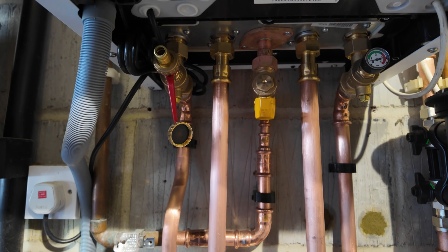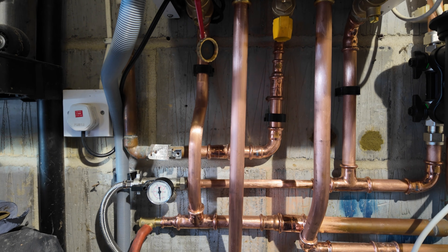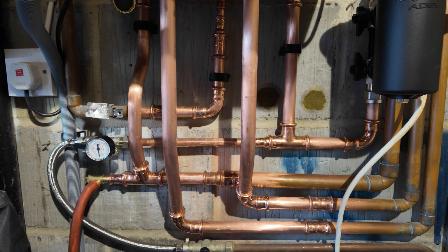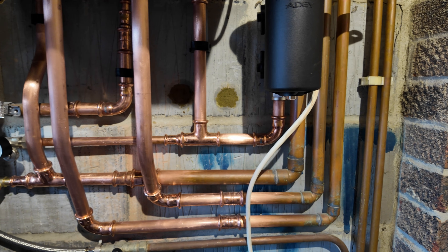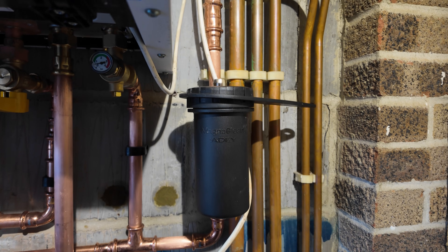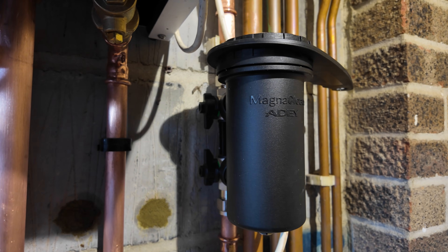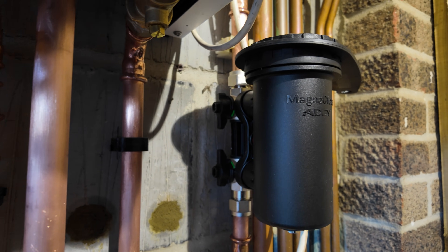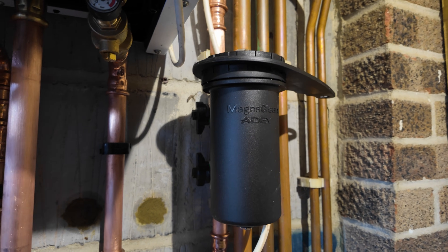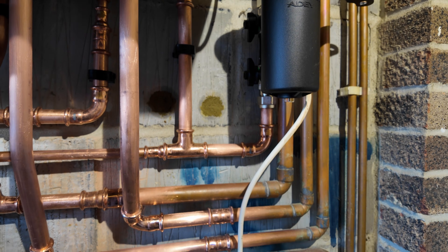I've ordered these from Lawton — they are three-quarter flat face compression fittings, they come with a washer, and this is actually a press fit connection: press to three-quarter female. They work really well so I highly recommend getting some of them. If you're thinking about doing this four pipe setup, this boiler won't come with those brass connections. It also doesn't come with the 10k ohm sensor — that's the domestic hot water sensor you'll need to measure the hot water temperature. On this job it already had a 10k ohm sensor running all the way through the house and I've just connected that up and it does seem to be working. I've gone for the Adey MagnaClean — in my opinion this is still the best filter on the market. The Adey Professional 2 is the best at collecting sludge and debris. I'm not sponsored by them, I genuinely believe they are still the best filter out there.